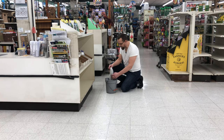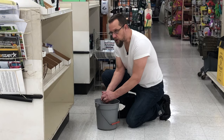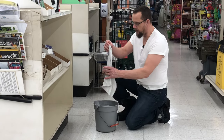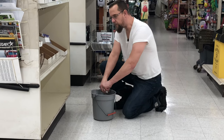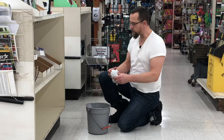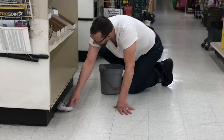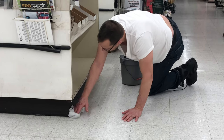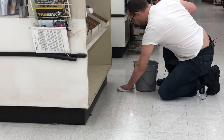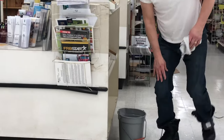Okay, so now we have everything prepped, and this is one of the parts where when you sweep it and blow it clean in the beginning with the leaf blower, you don't have stuff built up in the edges. Because what we like to do when we're done, standing up 5 feet away, it looks clean. When you get up close to it, there's still maybe some stuff here. The machines aren't perfect. So I'll take a microfiber cloth in a neutralized solution with one of those packs, and I'll go around and hand clean all the edges. So this looks really, really nice when I'm done.